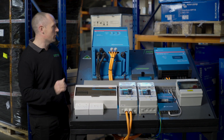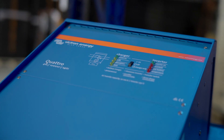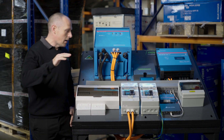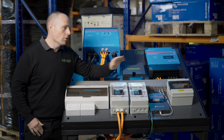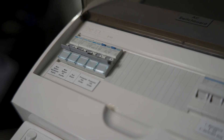Powering the system, we've got a Victron inverter up here — a Quattro 10kVA, which is a pretty standard size for running a medium-sized house. We've then got our DC charge controller, which is a Victron Smart Solar 450/100. That can handle about 6.6 kilowatts of solar.